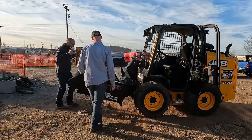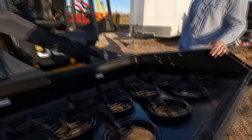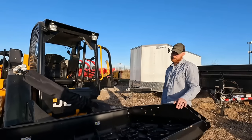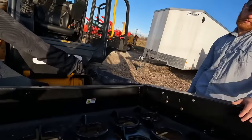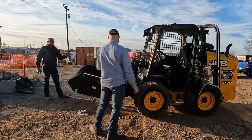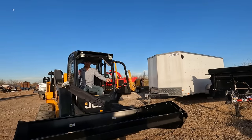The bags hook on with the speed loader — you rotate it upside down to set the bags in and lift it out. It's just PVC, so it weighs nothing. The bags sit loose under these ridges and you load them through the chute. When you're ready to drop the bags, that's what forces them out. What a badass design — it's 20 bags at a pop. In the first half hour, you'll load what somebody could load manually in one day, and that's in ideal circumstances with a pile of sand, a perfect shovel, and bags ready to go.